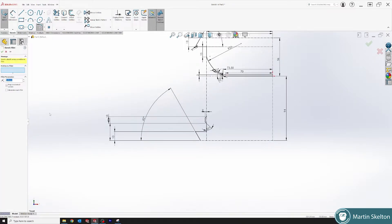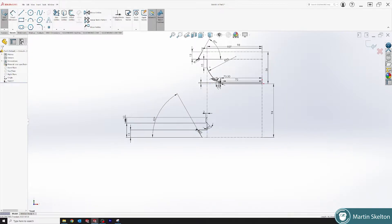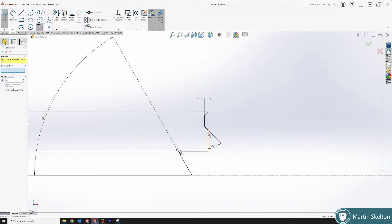We will add a 1.5 radius fillet from this line to make it the same as the top. Then we add 0.5 on these three points. Now we just have the piece to contend with. Drop our construction line - this line equals. Drop from our center to here, we know it is 2 millimeters.